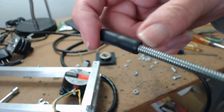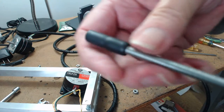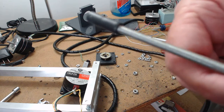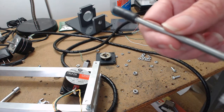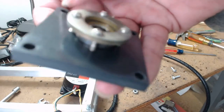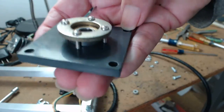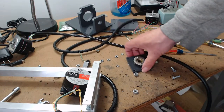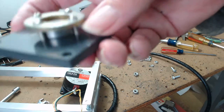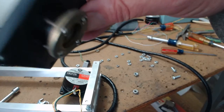I'm talking thousandths of an inch. When your drive nut gets all the way up here, this thing can't be crooked from one end to the other. It'll start to bind. And the same with this. Any imperfection in the holes, the distancing of the holes, or your frame can be nulled out with this captive nut, captive bearing.